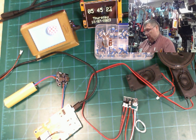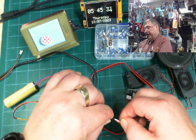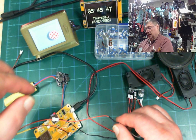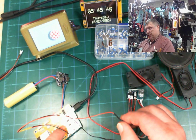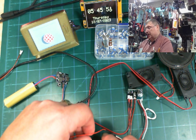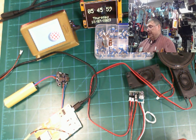What I did is combine the two channels to mono — the red and white are the left and right signal. I taped them together and put an input through this little cable, which comes from the ESP32. You have to make sure that you have ground to ground, and that's pretty much it.